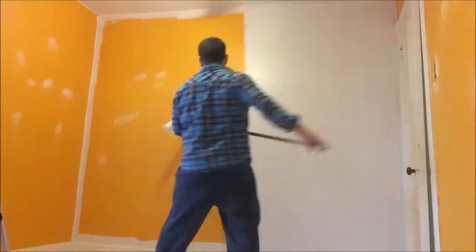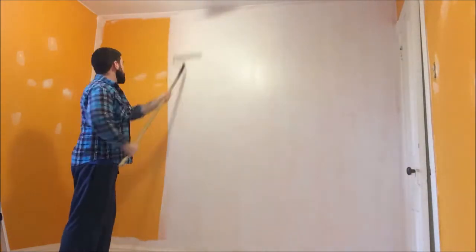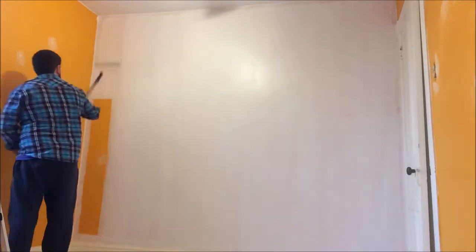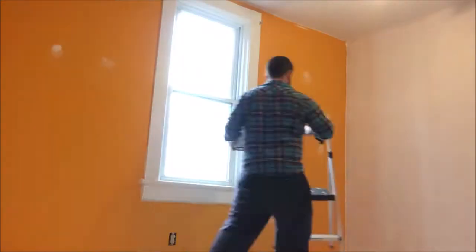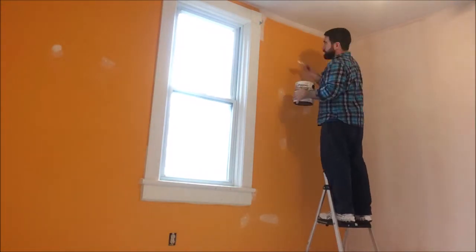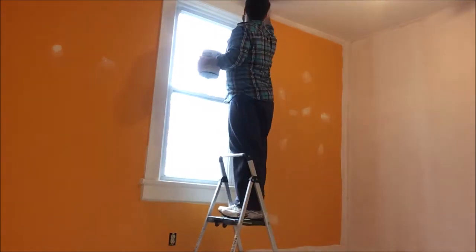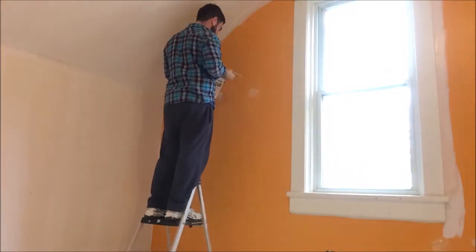I'm working right to left, top to bottom. I just like to go in one roll from the top to the bottom. I usually start away from where I stopped each time and then work my way back a little bit, just to have it as nice and smooth and even on the surface. I don't want to see any rolling marks from the edges of the rollers — so it's always a good idea to go back and forth.